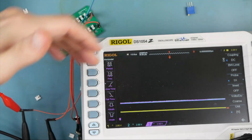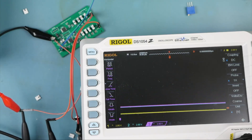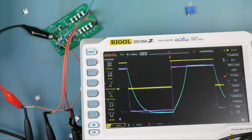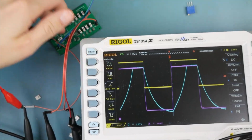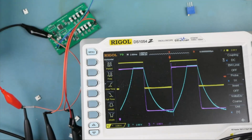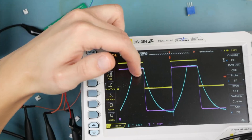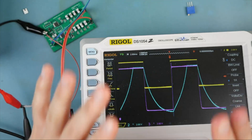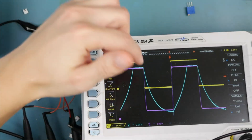Channel three, which is buffered, can't achieve the same output voltage — there's a 0.7 volt, one diode drop of additional output range loss. Now, if that is not a beautiful picture of what this buffer does, I don't know what is. Channel two is the unbuffered version, channel three is the buffered version. Our BJT buffer is just slamming that 20 microfarad output capacitance around — it has absolutely no respect for that output capacitance and is doing a great job, whereas the maximum output current of our OP07 is slowly pulling the output. This is the best case scenario for a capacitively loaded op amp.